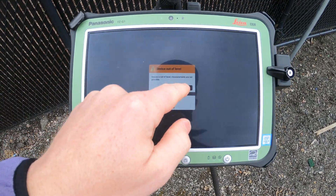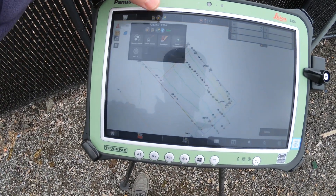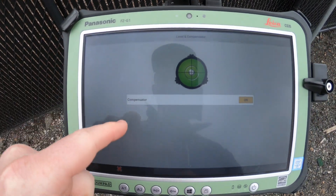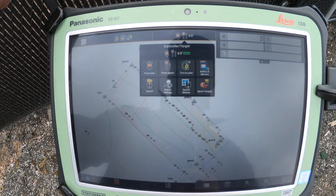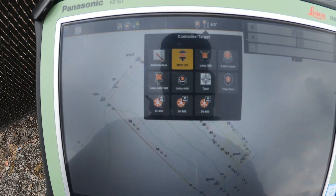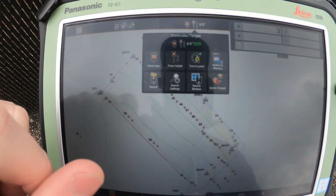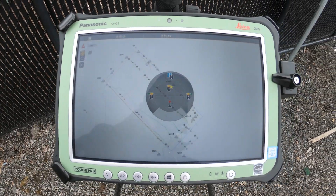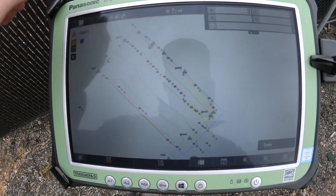Whenever you are in an application, you have a whole new set of buttons. Here at the top you've got your total station controls — you can have it be a laser pointer or a guide light. Level and compensator: you can see mine's not level, which is why it keeps alerting me. We've also got controls for what prism type you're using, with all the different options in 6.7. You can also change the prism height depending on what you have set, and then we've got our search function, which is what we'd use to have the total station find the prism.